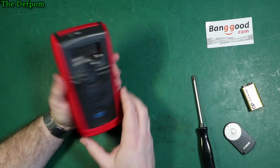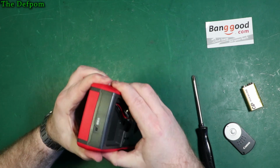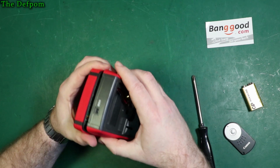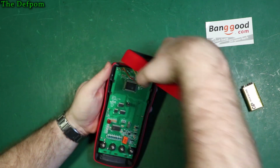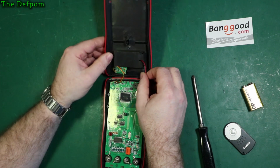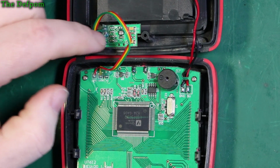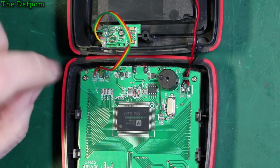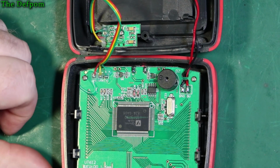So, does it open up? Yes, it does. Here we go. It's got little hook clips up the top, and that's what's up there. So let's fold it over this way. Try and rip the things out. Okay, there's the USB port. It's got hot glue on the terminals, on the wires, so they don't break off too easy. Bit of strain relief. That's a nice little touch.